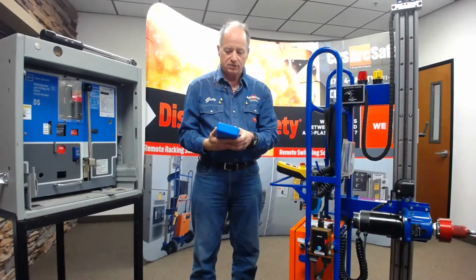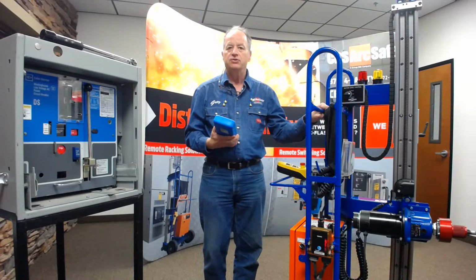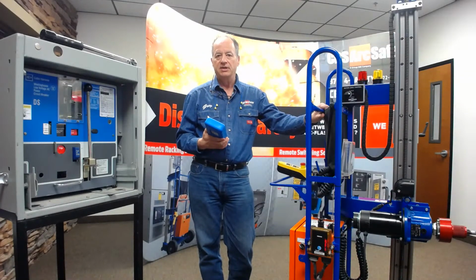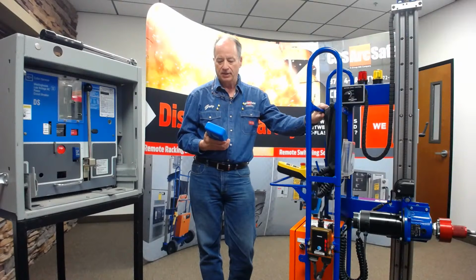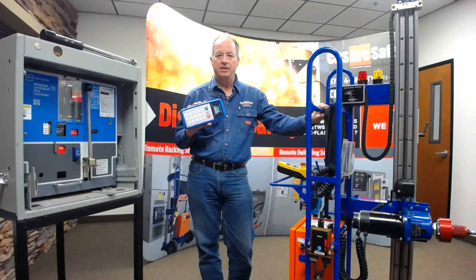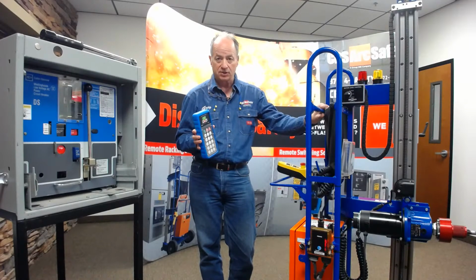I have been in a cement plant not far from here with a 294-foot arc flash hazard boundary on the medium voltage lineup in one of the two primary feeds for the facility. We did the demonstration sitting about 100 meters away outside under a tree in the parking lot. The radio remote is good for out to 100 meters with a clean radio path. So if you've got a metal building, you're going to have to leave a door open for a clean radio path to the radio remote so that you have a good radio signal going back and forth.